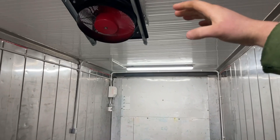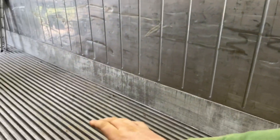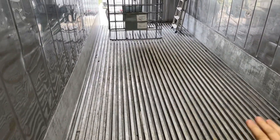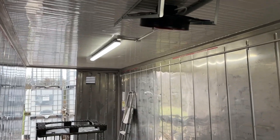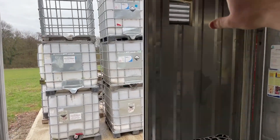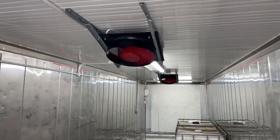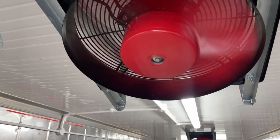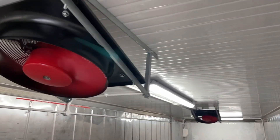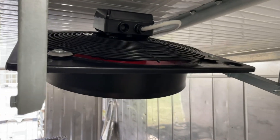There's going to be a lot of air. The hot air sits at the top of the container. The fans will catch that, push the air back down through the IBC cages, where it will dry the logs throughout the logs. And then this one will do exactly the same. Hopefully there's going to be a nice wave of air going down through the logs, and then back up, and then the wet air will go out that vent there.